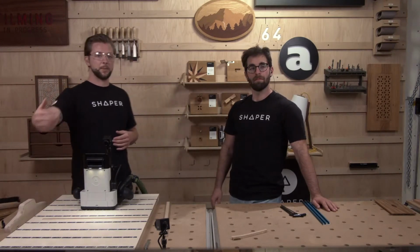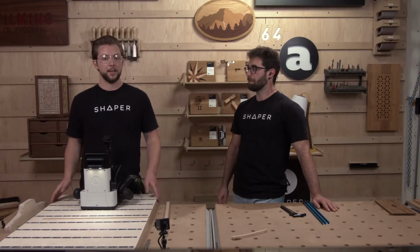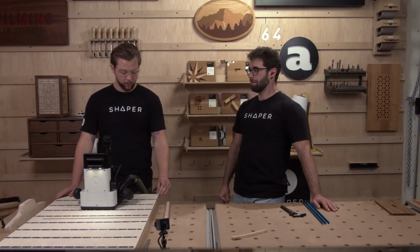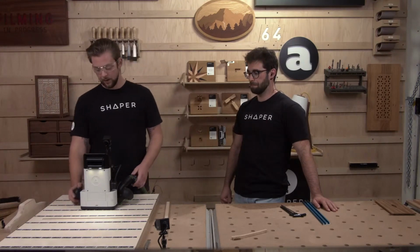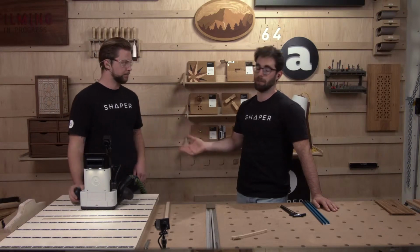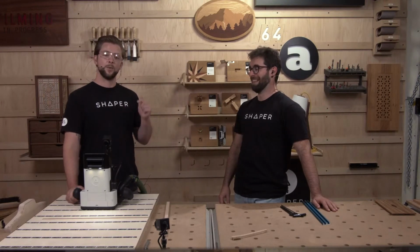So I want that little extra bit of material up at the front so that I could still have space for shaper tape. And the nice thing about having it cut to 24 inches is it saves me some cutting, because I'm just placing my design to the very corner, so some of these straightaways are already cut by saw. Pretty nice. And those are not your reference edges for your fence or for your rail, so if you're not cutting them, then it's totally cool. They can be rough. Everything that we care about as far as perpendicularity, we are going to cut.